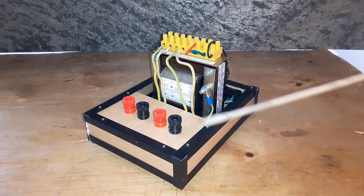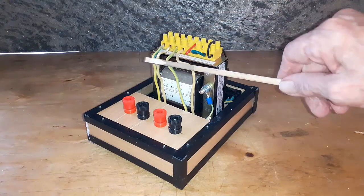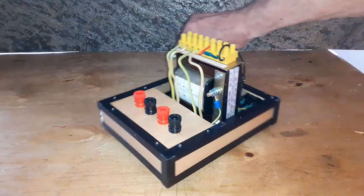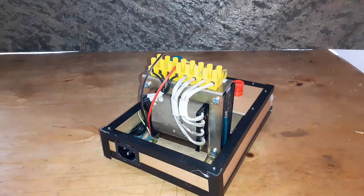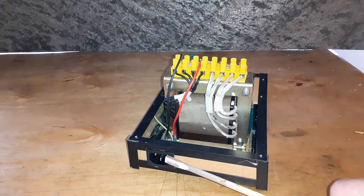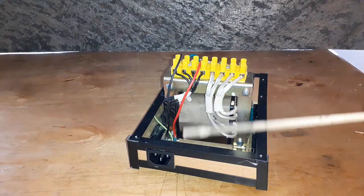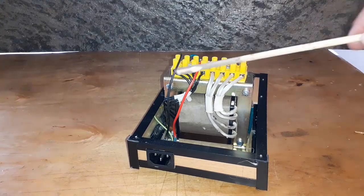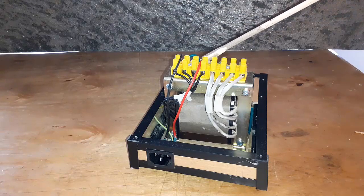So on the output side, simple, we have the banana receptacles, a couple pieces of wire. This is regular wire from the wall, cable, nothing fancy. It has to be able to handle 10 amps. On the input side, I've put a receptacle. One part, ground, goes over. Then we have the positive and negative, or two connections as AC. We go to the two points on the wiring diagrams included for you.